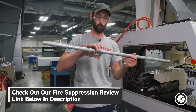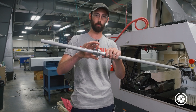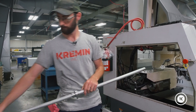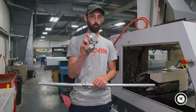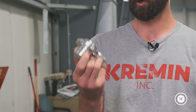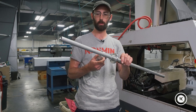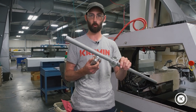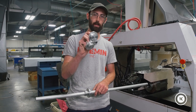So we just turned this tube up out of aluminum. We just turned this bushing up out of aluminum. When you're doing that, make extras — because you might not always be running the same size through tube, and you want to have extra bushings on hand ready to go. We can drill these out — these are blanks — for whatever size tube we need: half inch, three quarter, inch and a quarter, whatever size tube. We've got extras on hand ready to go.